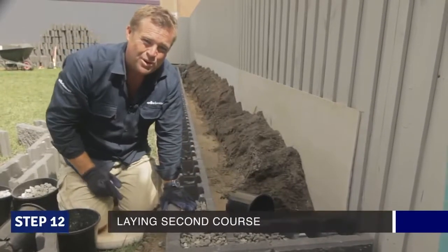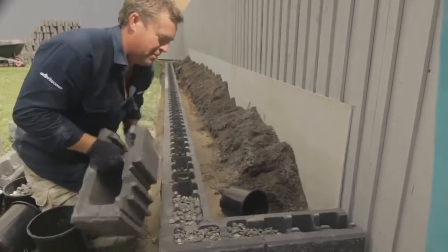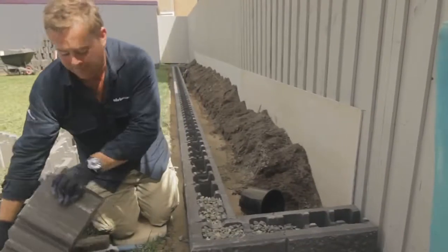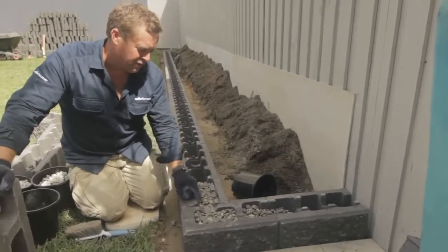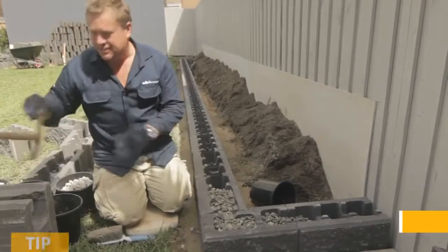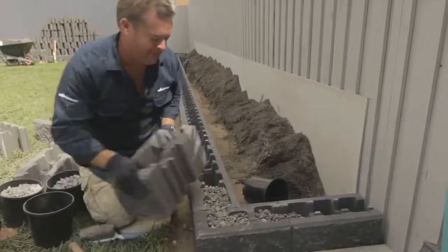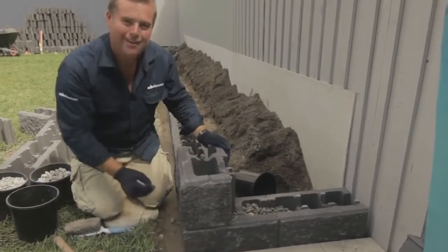For the second corner, there is one tip and one trick. If you put the left-hand block on top of that right-hand block, it looks good, but look at this — it wobbles. And the reason why is because the standard block that runs through here has these eight lugs. The first two hit the base of your corners. So what you need to do is grab a scotchie or a hammer, knock those two off, and your left sits on top of your right. No problem.